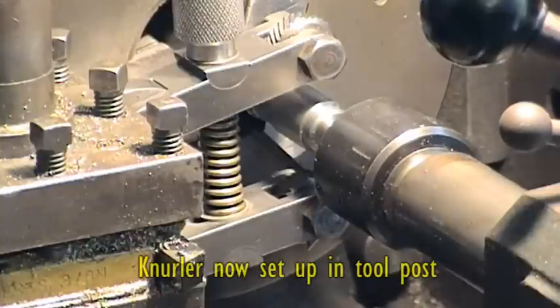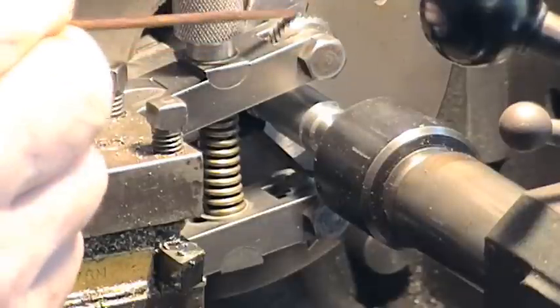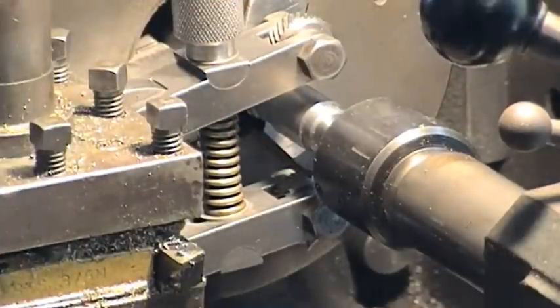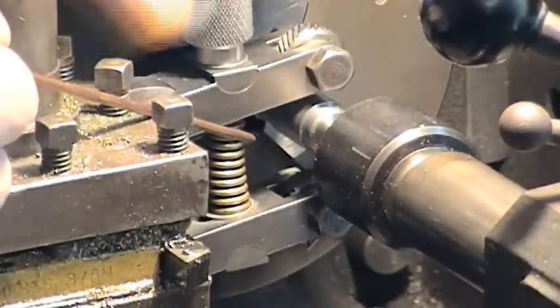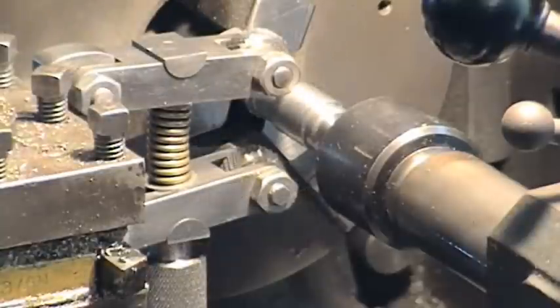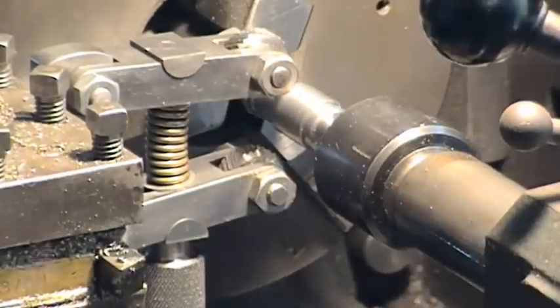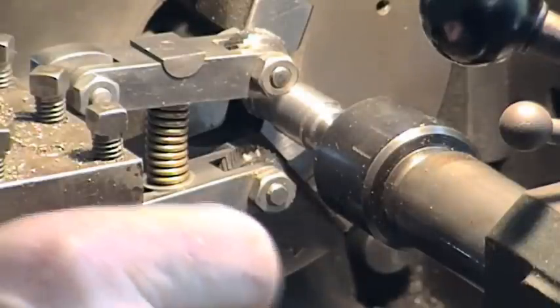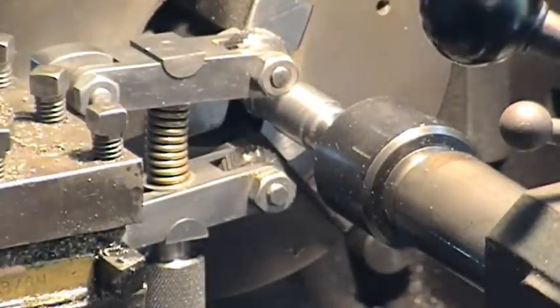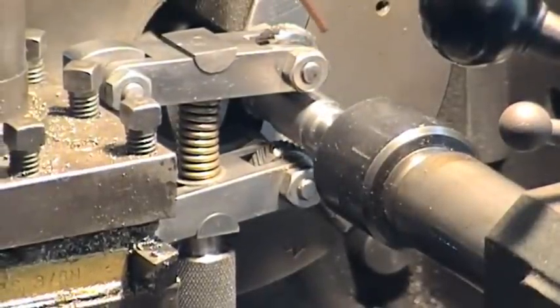What we're trying to do here is to get the rotational axis of each wheel — one top, one bottom — more or less over the center of the work piece, and we're then tightening down, compressing the spring. I've actually just flipped the straddler knurler in the tool post because the adjustment is now down the bottom. That's because I'm working on a fairly small diameter piece; on large diameter stuff it can be the other way up.